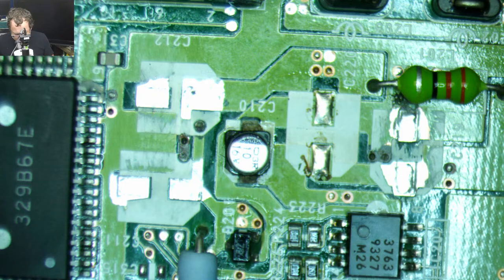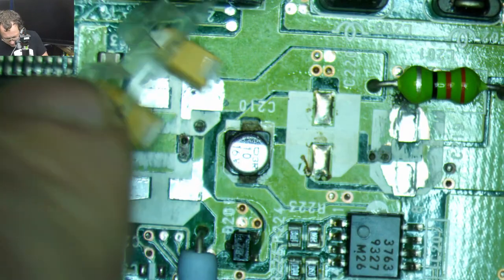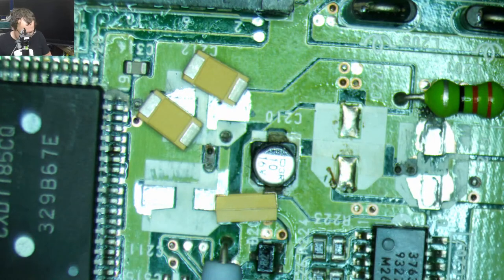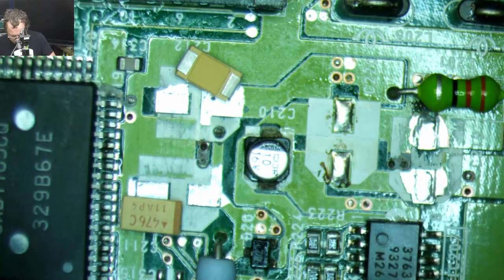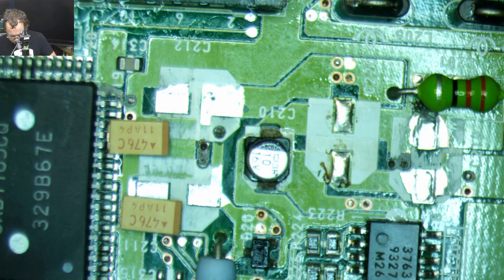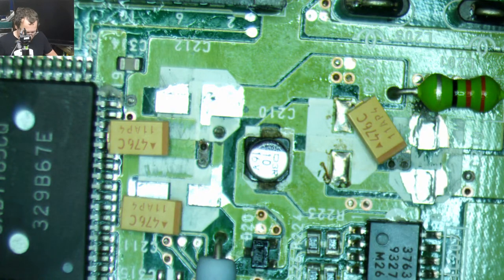Sorry, I thought this job was gonna be an easy one. Well, at least I cleaned up the TV tuner board a little bit. I did have another little issue arise right before the stream. The hard drive in this thing died. So it refused to boot up, but luckily I had made a backup on my 2CI, which is basically my main Mac machine at this point, and so I popped it over to a new blue SCSI and it booted back up again. So even though we don't have the original 160 meg SCSI drive that was in this thing, we got something.